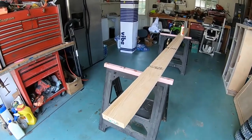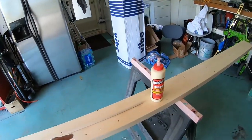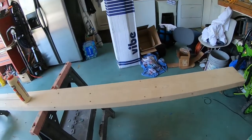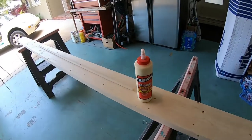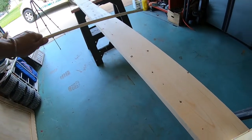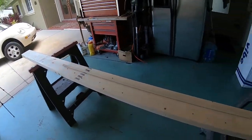So I think I'm going to try a project that I've seen. Rather than buy it, I'm going to try to get crafty and build a kind of a surfboard coffee table, which I think will be pretty cool. I'll show you what I've got to work with and take you along in the journey. Starting with a 2x6x12 — Southern Yellow Pine — very cheap, it was a $15 stick of wood, 12 feet long. I'm going to chop it; the table needs to be 45 inches tip to tip and about 36 inches wide. I'm going to dowel the pieces together so when I sandwich them they'll lock in and be a good joint. Then we'll lay out the table and glue stuff together. Wish me luck.